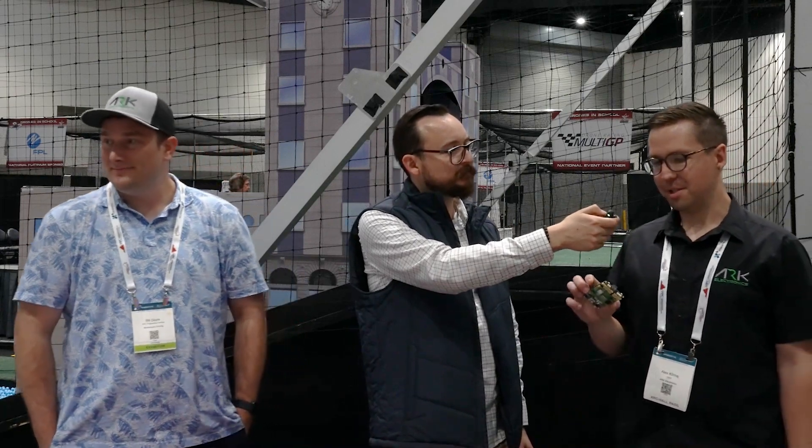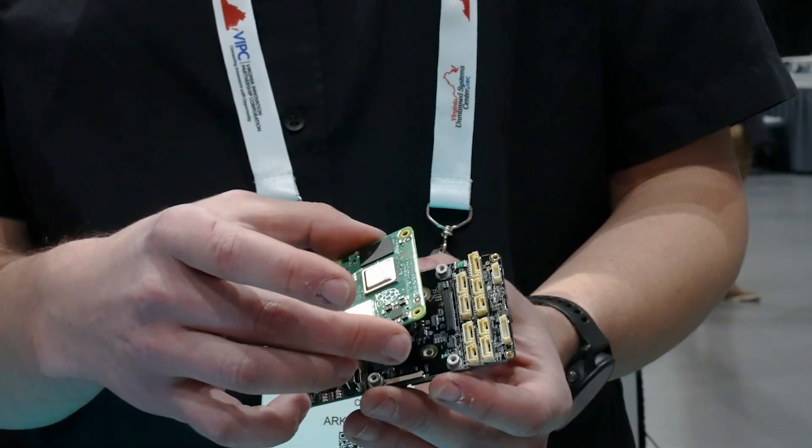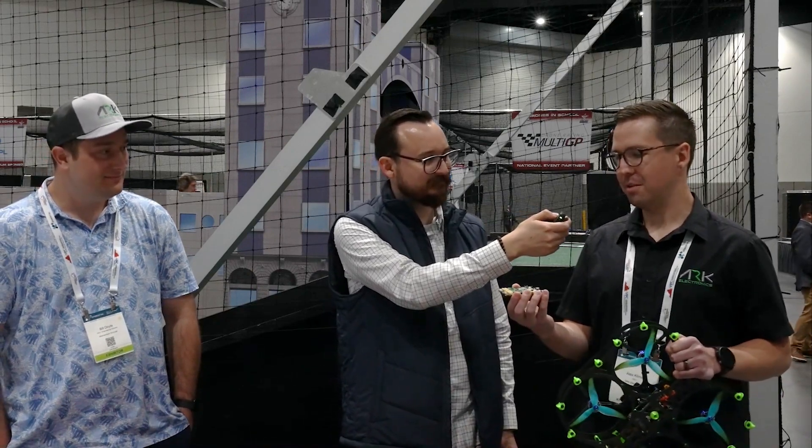So what can you tell us about the open technologies within the kit? This is based on the ARK V6X flight controller, which is based on the PIXHAWK FMU-V6X standard, and that is integrated onto this board. So this is all open standards integrated together onto one board — Raspberry Pi Compute Module 4 carrier, combining everything together: Mavlink, ROS, and DDS running on here. Pretty much everything open source is running on this product.